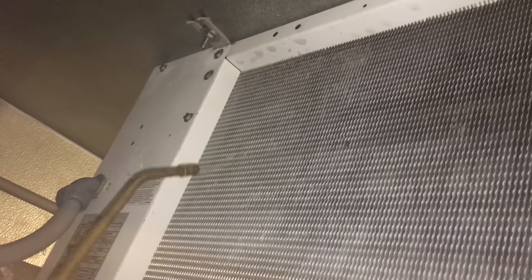I gotta rinse down this side — I can see some scum right over here. Nu-Brite did a pretty nice job though. If the coil is real bad you gotta take apart the drain — cut it and put a union in, take the pan off. I'm not going to take the pan off on this one because I keep it pretty clean. The problem is the bozo that put this in used a slip coupling instead of a union — that's the difference between doing it right and doing it cheap.